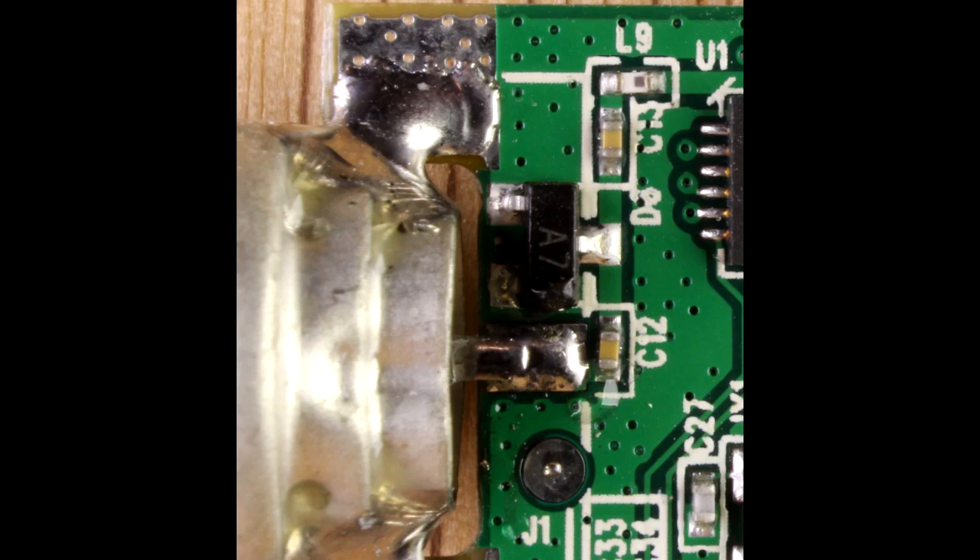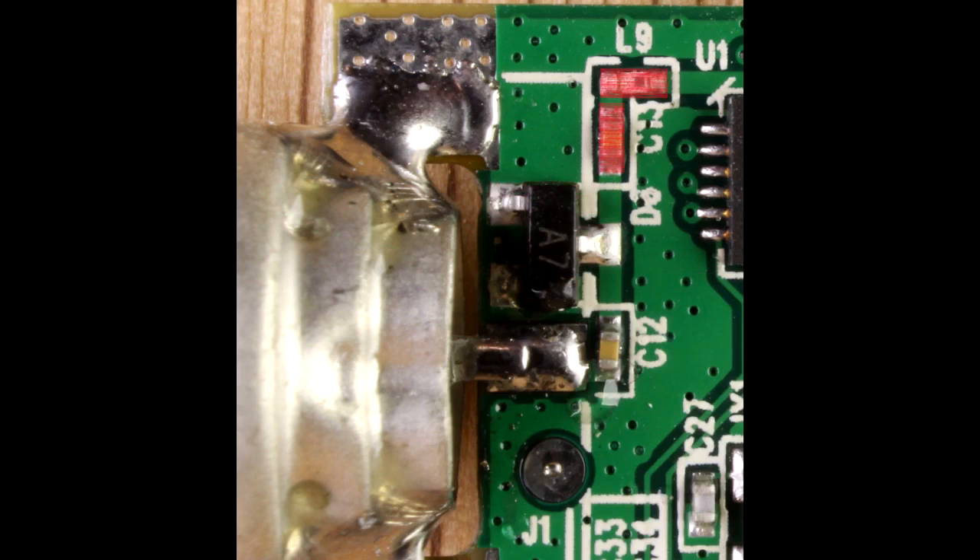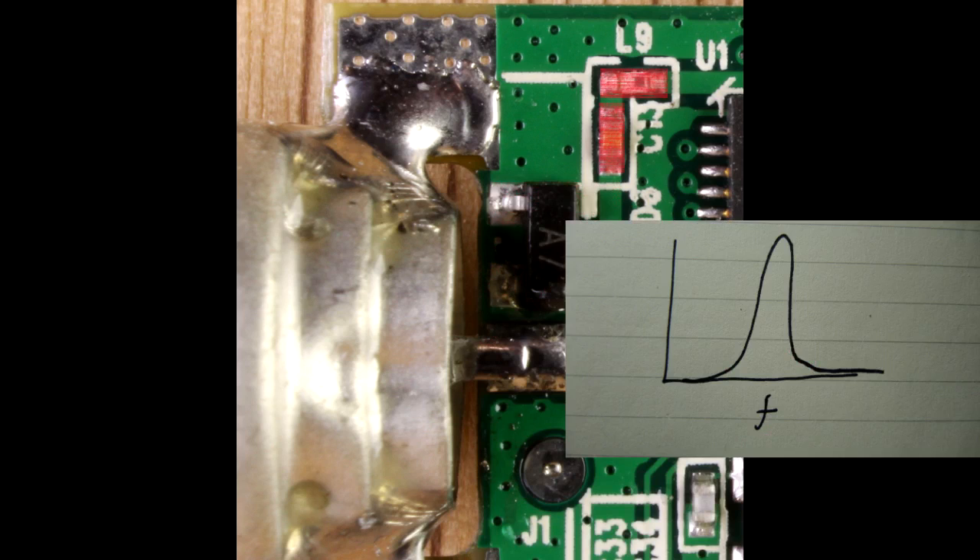Let's see what we can sort out down here. Looking at the RF input: it goes to a capacitor to start with and then it goes to that integrated circuit. Those are two diodes back to back — basically a clamp, so if you put too much signal into the assembly the diodes will clamp it out to prevent it from damaging the IC. There's a capacitor and an inductor in series, which almost certainly will be a bandpass filter. That makes sense — you only want the frequency of interest to go into your chip.